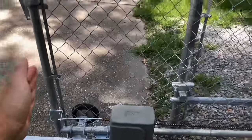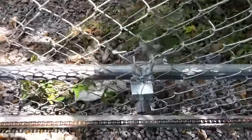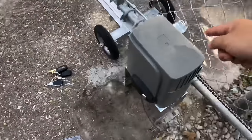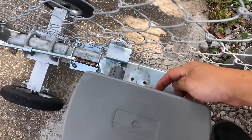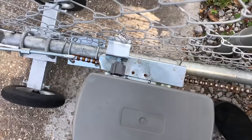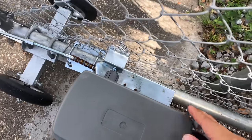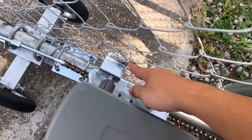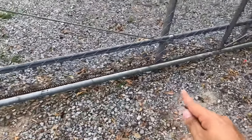The next hardest part was installing the magnet pieces. There's one magnet piece on each end of the gate. When you close the gate, the magnet on the gate meets the magnet piece inside the sliding system unit. Once it touches, it automatically sends a signal to the system to disconnect the power, causing the gate to stop. That's what signals the system to stop on both the open and close cycle. You have to position these carefully to match the magnet piece in the unit.